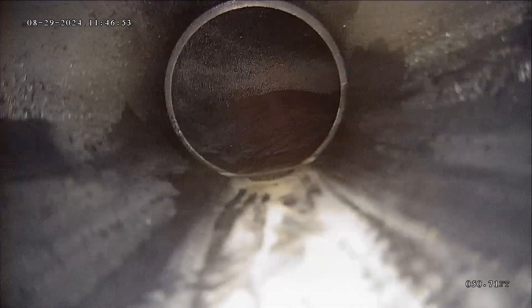All right, this is Andrew with Joda Home Inspections. We're doing a sewer scope today here in Tooele at 422 West Courts Road. We have the camera pushed out just over 50 feet. We're definitely not yet to the city connection. This line has a lot of turns, and so right now we're just seeing what's underneath the basement slab. I'm going to do a second video where I scope from outside and look at where it's running through the yard.